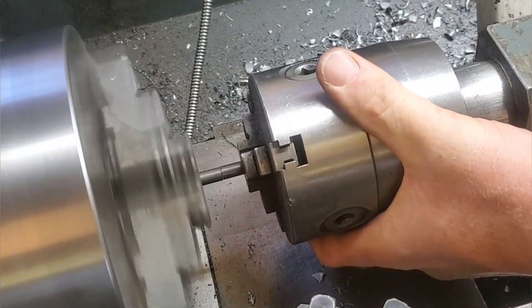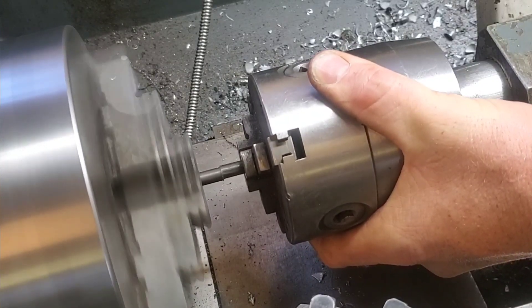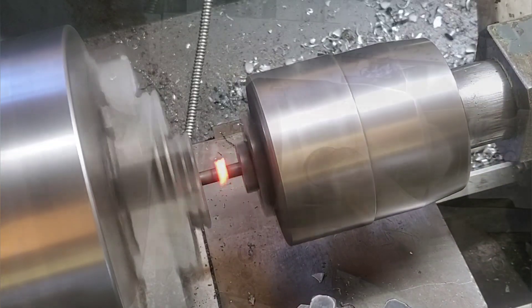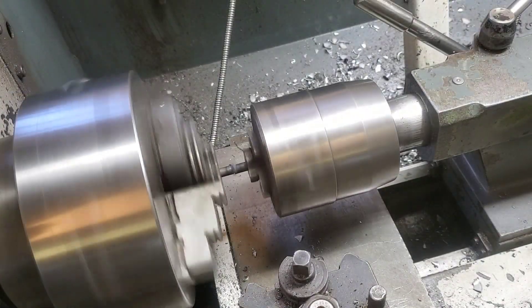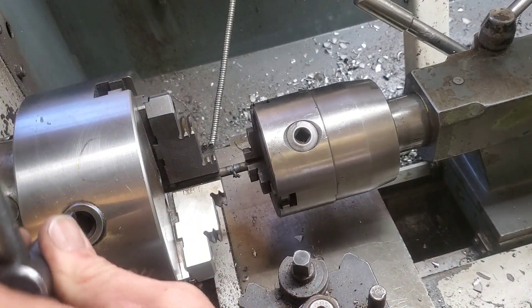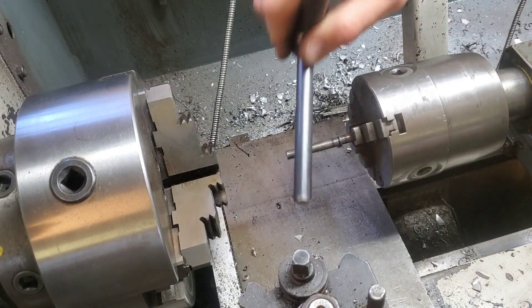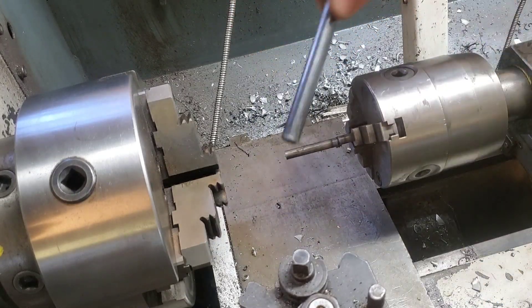In this experiment I'm just going to go for gusto — slam it together, put a bit of horsepower to it, and just automatically friction weld it together. Notice how it kind of wobbles around as I'm pushing really hard while it's cold. Clearly you can see it unevenly mushroom as the two surfaces are pushed together, spitting out just to one side, making this not such a straight weld. You're not going to be very happy with this because not only is it not going to be straight, it's also not going to hold together very well and with minimal force it'll snap apart.